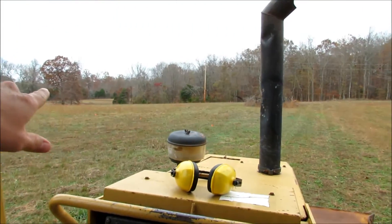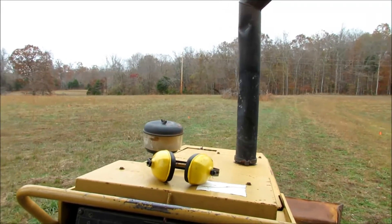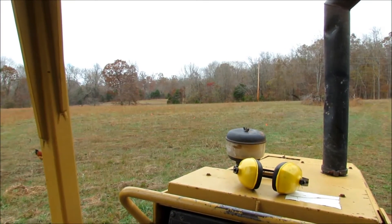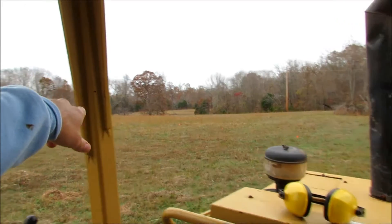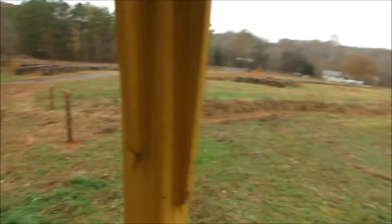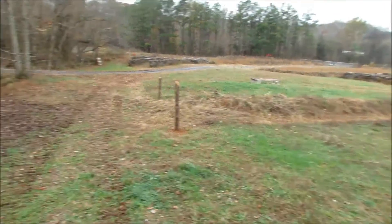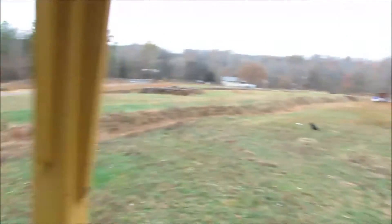This swale will fill the pond and the pond will fill into the swale. If you can see the flag lines, I'm actually going to put the spillway for this pond way over there in the middle of this field, and it'll dump into this swale, which will then flow out here. Here's the spillway for this swale, which will put the water back where it naturally wants to go.